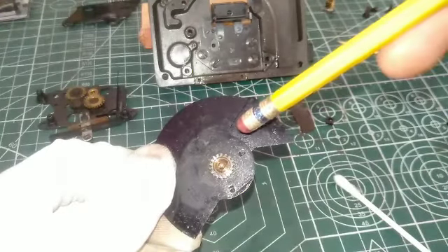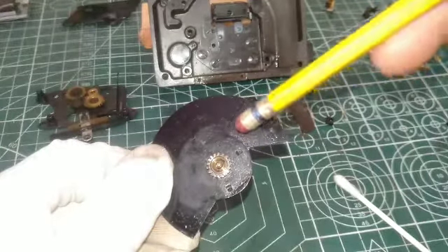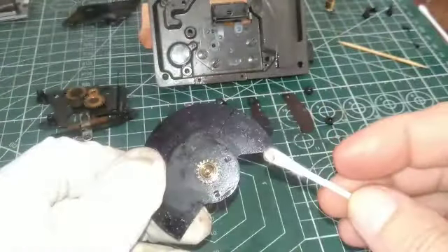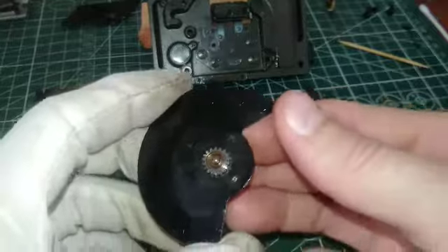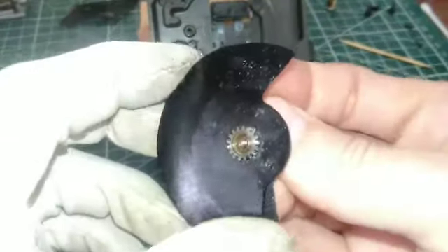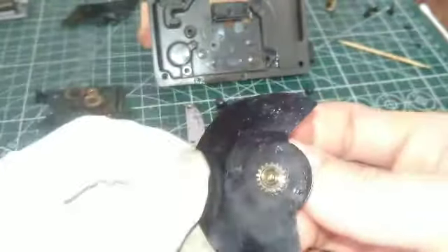Also I'm going to show you the back of the shutter here. Look at this old graphite grease down here in this trash at the end of my pencil eraser. And even back here on the inside of this gear — I can actually pull this out. And actually if I turn the shutter a bit, if you listen really close you can hear it grind. That's not good. So all this is going to have to be cleaned.